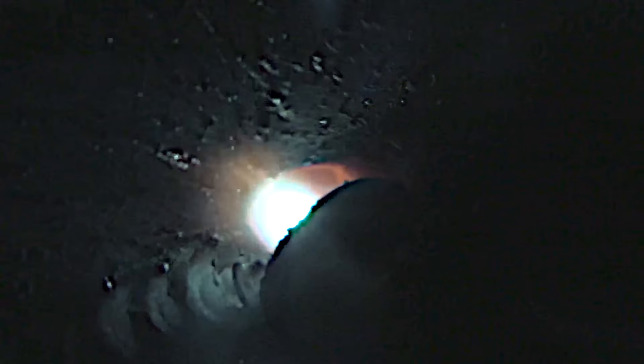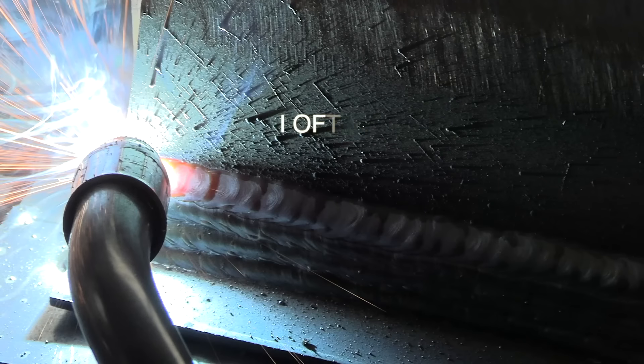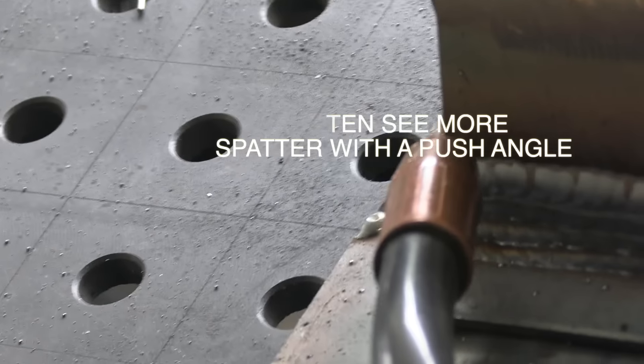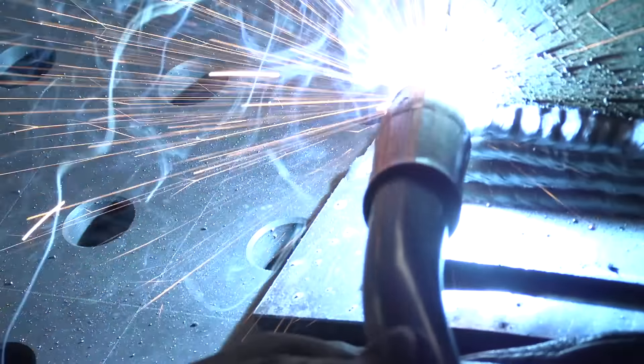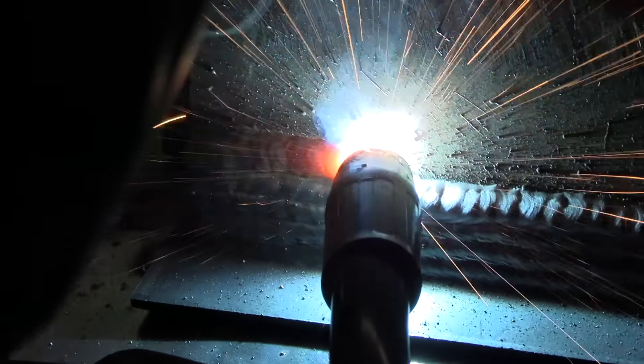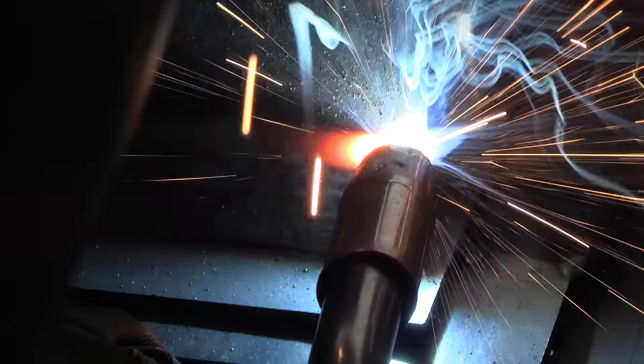There are some differences in pushing and pulling. One difference I always see is a little bit more spatter with a push angle — doesn't mean it's a bad thing, just an observation. When I pull, I can see the puddle better; when I push, I can see where I'm going better — I can see the weld seam better. So there's a trade-off. Sometimes you have to do each. Sometimes your head is up in a box and you have to weld toward yourself or away from yourself with no choice. So saying you should never push or never pull is kind of silly, because I've had to do both.